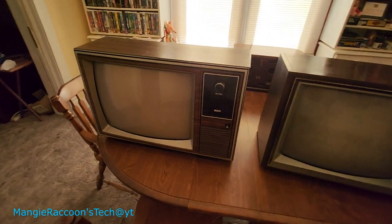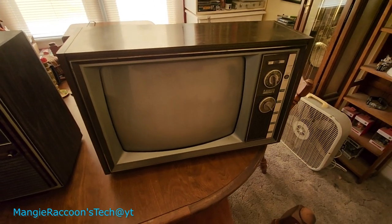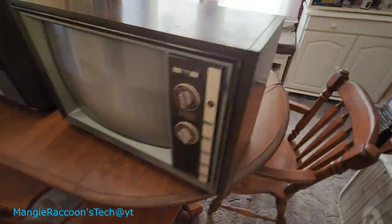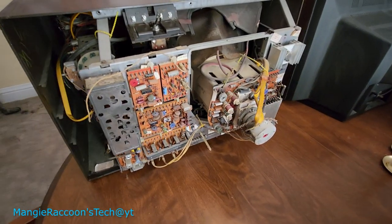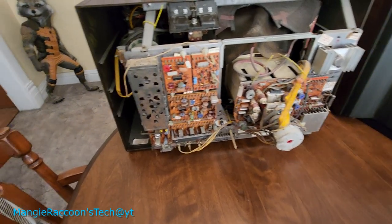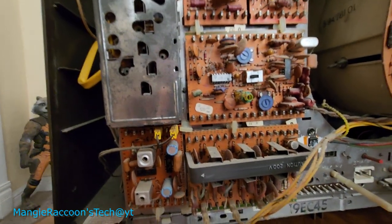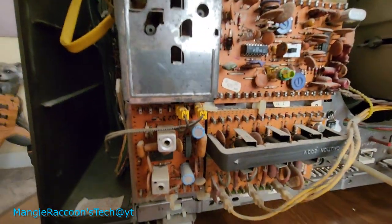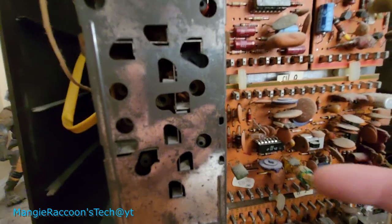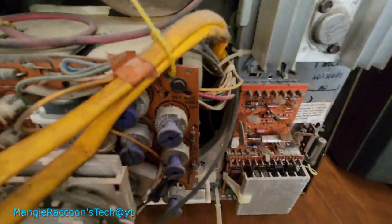Well, she sure cleaned up nicely. Didn't quite put as much effort into the RCA — I'm really digging the Zenith myself; even threw a little bit of furniture polish on there. All right, let's get the back off and see what we got under the hood. Wow — this thing looks just like the bigger console I have. Got the AGC, luminance, the chroma board I've been messing with. I think it's the earlier chroma board — 9-8-6, no 1 or 2 or A or B. Wow, look at the huge heat sinks on these transistor outputs — and they're socketed! The chips I replaced are socketed on this one. Boy, this thing's beautiful. There's the vertical board, horizontal...